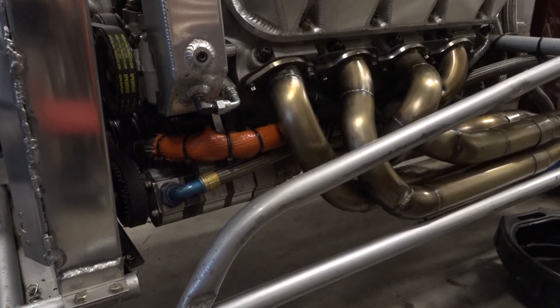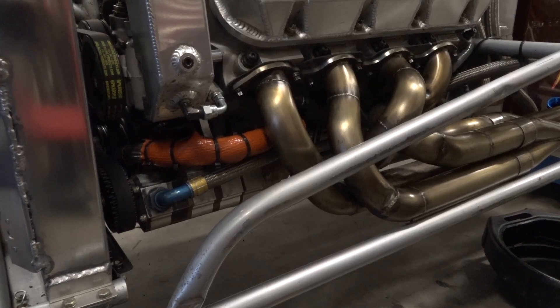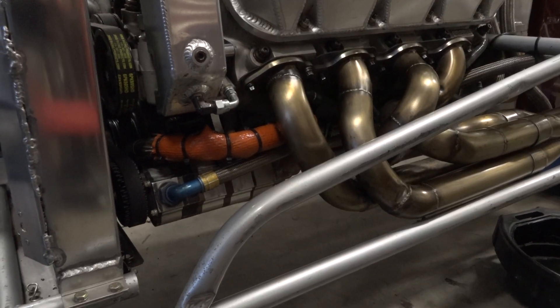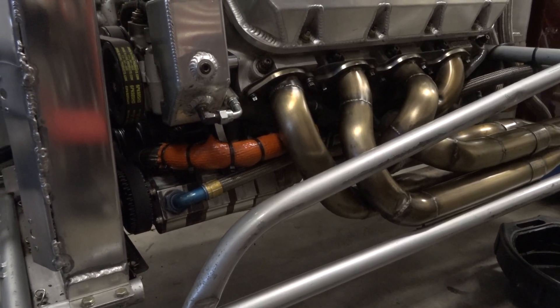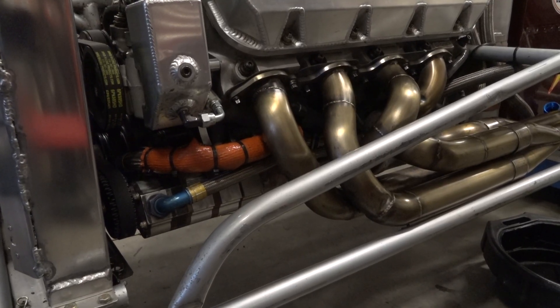It's all about efficiency and drag — if that crank is going through a lot of oil versus a little bit, that is going to rob you some power. These supermodifieds are built for pure power: no transmissions, no anything, direct drive and dry sump. All horsepower right to the ground.